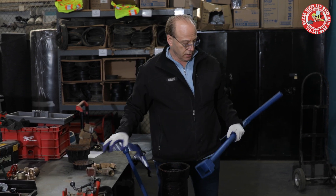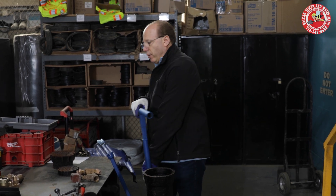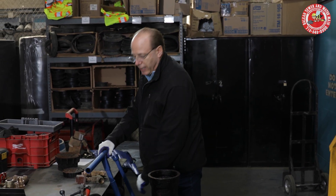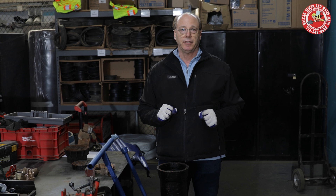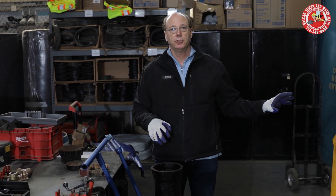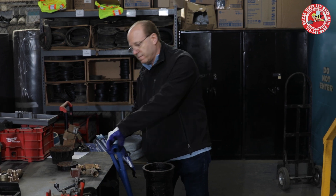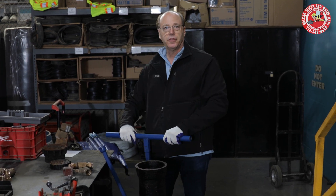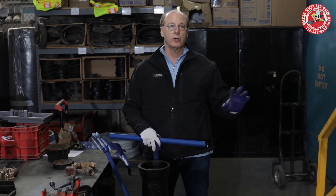Now, lastly, how folks get themselves into trouble. Frequently, when it's a gate curb valve, it hasn't been touched in many years and there can be corrosion inside. If you're not getting full closure, open up a faucet or two, take off the strainer or the aerator, and work the valve back and forth. That can loosen up the corrosion — it'll come out through your sink and then you can close the valve.